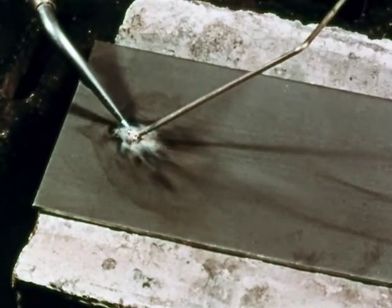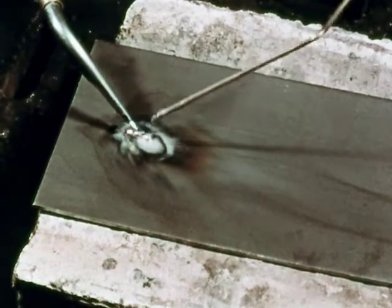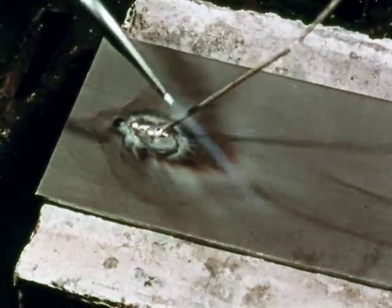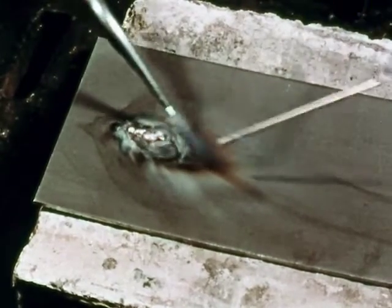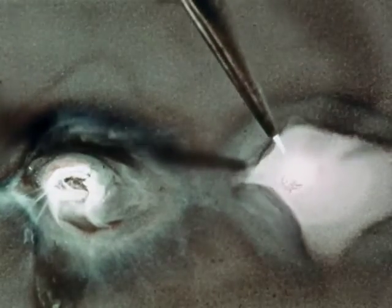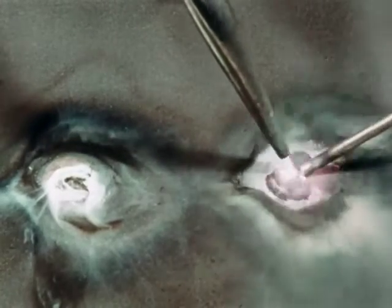Cleaning and fluxing are important to good tinning, but so is proper temperature of the base metal. Here's what happens if the rod is applied before the plate is hot enough — the bronze melts off in drops and builds up instead of spreading out. If the plate is too hot, the bronze boils and runs to the edge of the heated area. It behaves like water on a hot stove. That white smoke is zinc being burned out, spoiling the strength of the bronze.